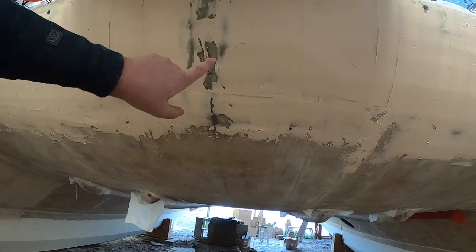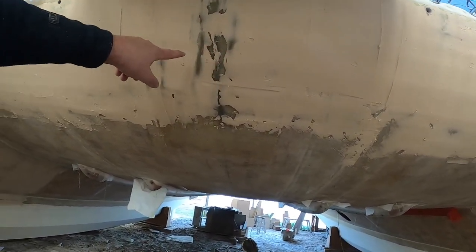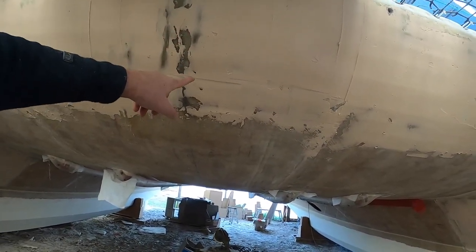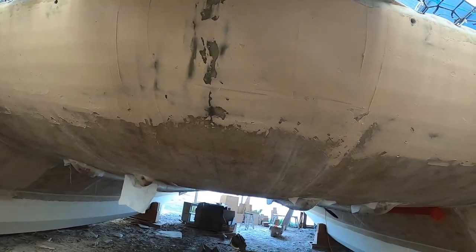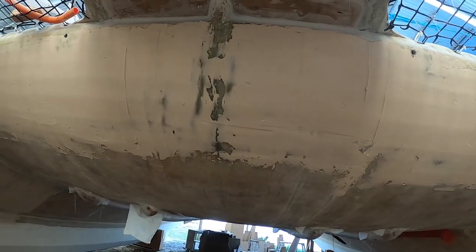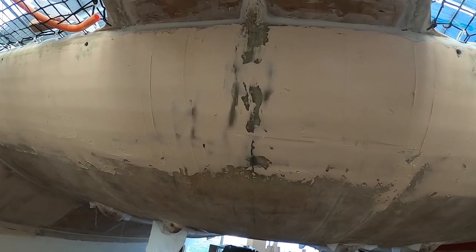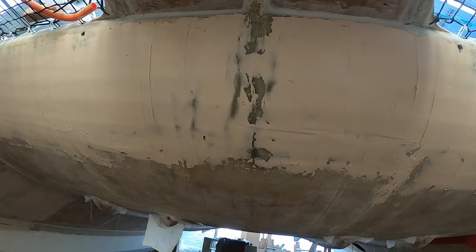I will fill up here a little bit — I don't want to take this down. There's quite a bit of a hump here, but this is structural glass. There's a lot of unidirectional glass here holding the inner forestay attachment hard point, so that's why that looks a bit weird. I'll put a bit of epoxy there before moving on to the next part of this boat.